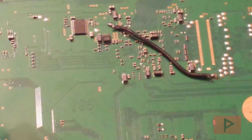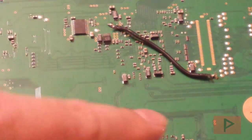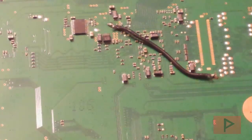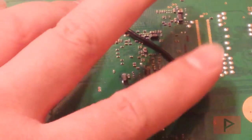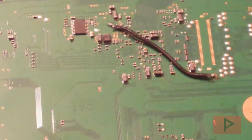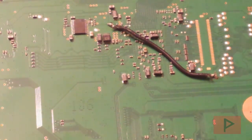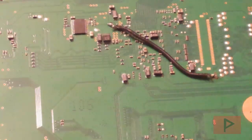The best method is to take a wire — this is gauge 22 or gauge 20 — and just solder the two points together. I know there are other people who said they used tape and didn't have to do any soldering. If you can get that to work, that's awesome. I had a tough time with the tape method; it was not a secure connection and my PS3 could not turn on. So I ended up doing the solder method and it worked the very first try. If you don't do this wire method, you cannot have your PS3 turn on and stay on.